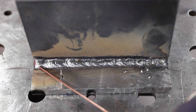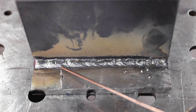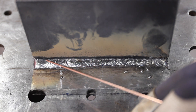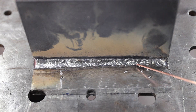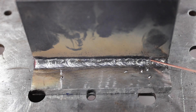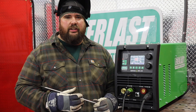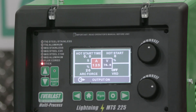I fired it up nice and controlled to show what it's supposed to look like, and then at the soapstone mark I picked up travel speed. I'm getting a V-pattern instead of a nice round pattern — that tells me travel speed is too fast. There's undercut propagating on the top, the weld is underfilled, and there's a void and a slag inclusion. It's not convex the way it should be. That's the firework effect — people think they have to move fast because they're afraid of blowing through.